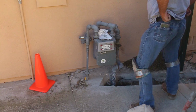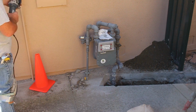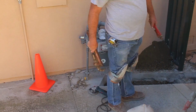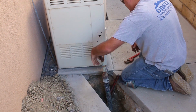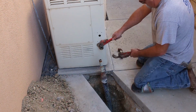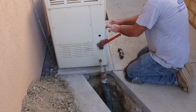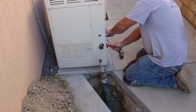Also with that marker, I can orient how the pipe will come up, so that it's coming up parallel out of the trench instead of on an angle or something like that, because I don't want to put a lot of pressure on the pipe, twisting it to make it fit. I just want it to be in the right place with no stress on any of the joints.